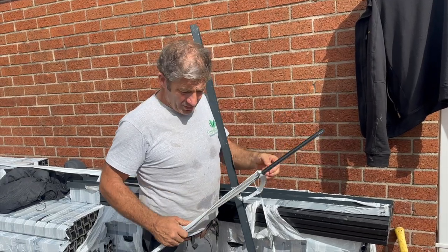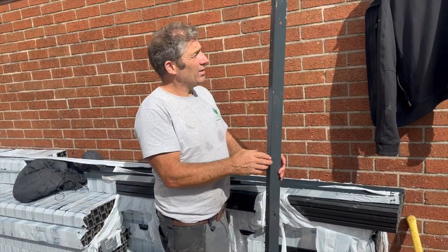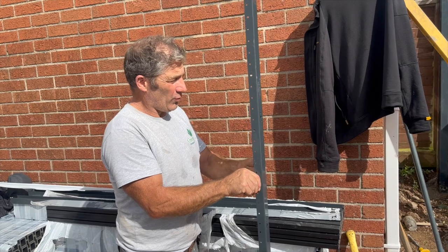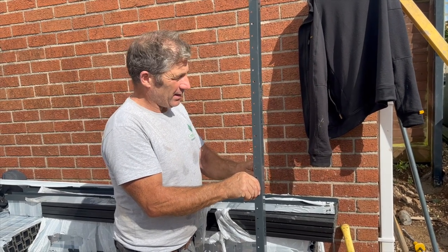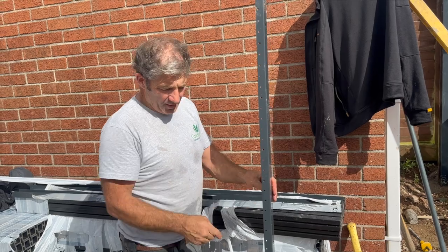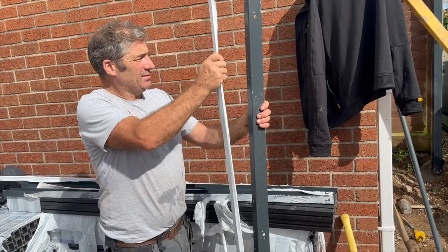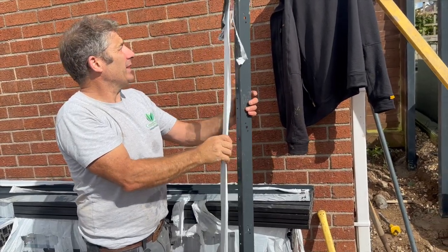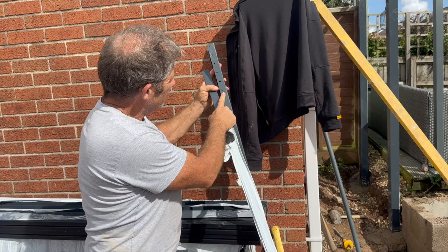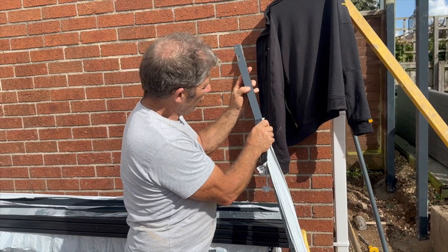What we're looking at here is a couple of different components. This is going to be fixed to our 4x4 posts — they're 90mm, I think. It's going to be fixed through here, and then when we put our composite fence in there it's going to be fixed through here too. Then you put some grommets on here and you slide this over the grommet, so you get this nice face on the front concealing those holes. It'll go over there like that — that's perfect. Good finish on that. They've really thought about this.